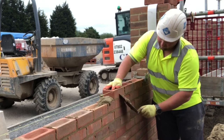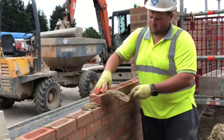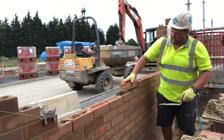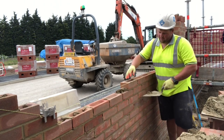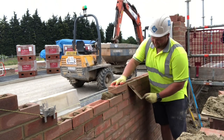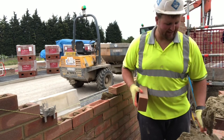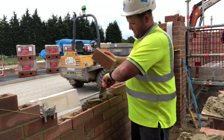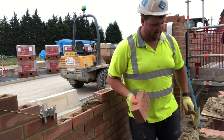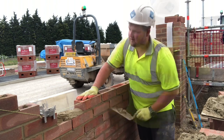There are four panels on this wall but two are really small, so I reckon if I can get all the brickwork up to height tomorrow I can get some tiles on and get it done. With only three pillars on it I can do the three pillar tops and at least three panels — I might have to finish something off in the morning. I've been backing off a little bit on the hours. I've been normally laying my first brick around quarter past nine and packing up around quarter past four, with an hour's snap.